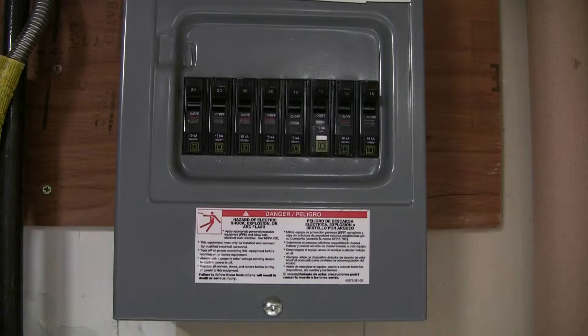I did not want eight circuits. What I wanted were the bedrooms — three of the bedrooms in this house, all for lighting. Everything's LED, so we're only talking maybe 200 watts max with ceiling fans and lights. I also wanted the bathrooms, which is just a light and the bathroom exhaust fan. I also wanted the refrigerator in the kitchen as well as one of the two kitchen receptacle circuits.